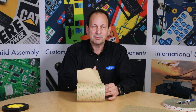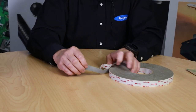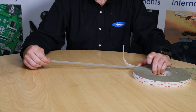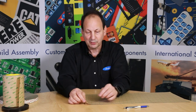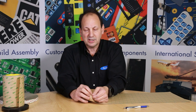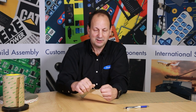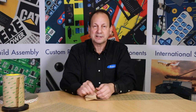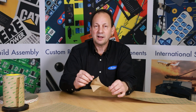So it's sticky on one side. This one is a structural foam bonding tape and it has some viscoelastic properties so it can stretch and absorb energy. Another version comes in sheets — a double liner tape that has two liners with just adhesive in the middle, and you can see how that stretches. For a little more structure, we go to the double linered spacer, which has a rigid carrier between the adhesive so it's a lot more structurally sound.